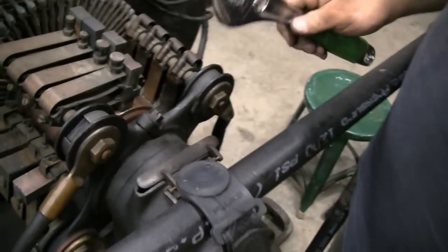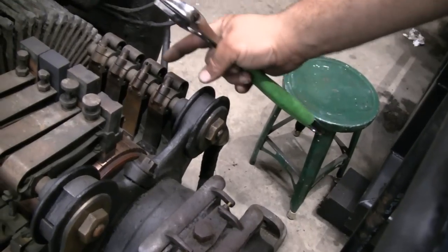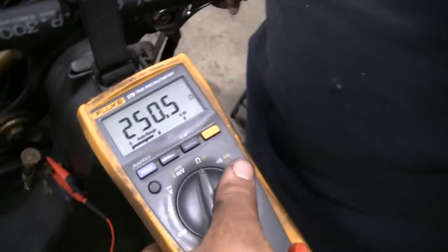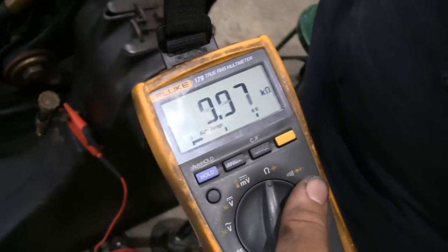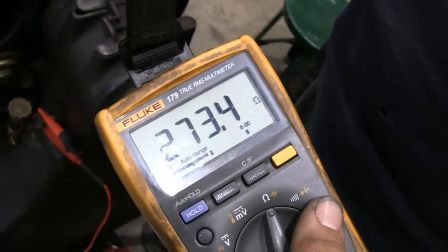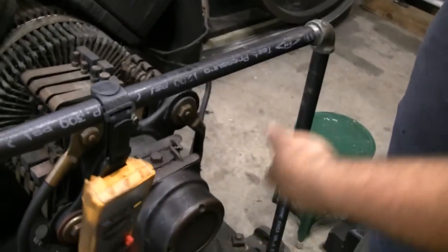So I recall when we were here back in October that we had issues with these insulating discs and the block on these brush rigs. So watch this, I'm going to loosen this up. Wow. Now we're at 10, 11 kilohms. So 9,000 ohms. Crank it back down, 200 ohms. So we've got major leakage there. And that's just with a 9 volt battery. Imagine what you're going to have when you pump 125 volts above ground through there.